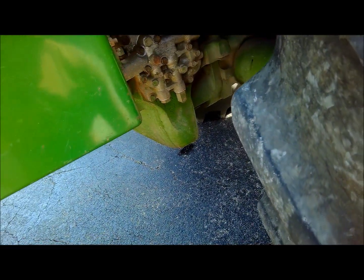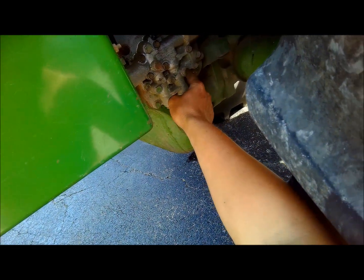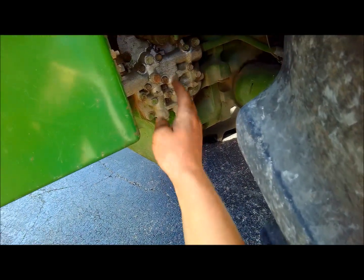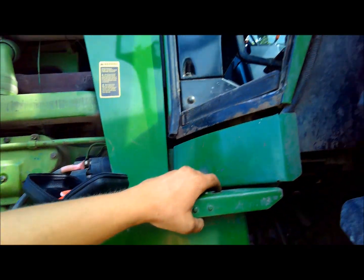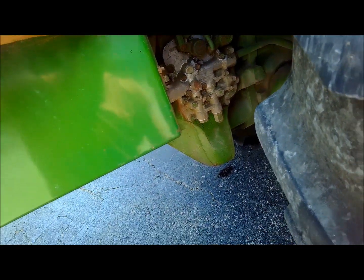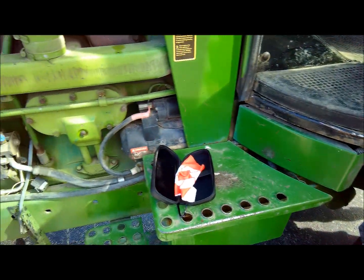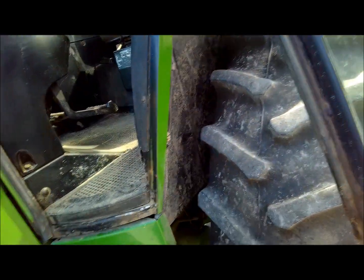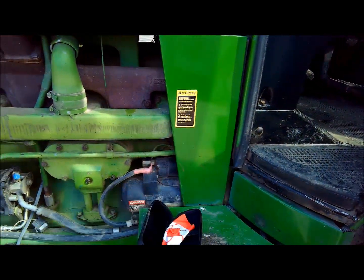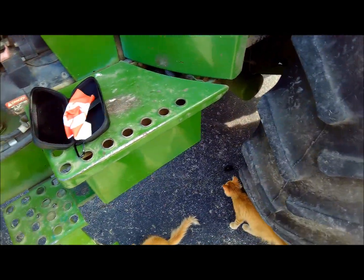And then he said, I'm going to get a service manual from him, but I can check the clutch pressure there on this valve body, and make sure it's dumping the pressure all the way, and that the clutch just isn't out of adjustment. But that sounds more like what's happening, why it creeps forward, and then all of a sudden it's finally all right, is once the piston gets back far enough, it can finally release. But I don't think we'll get into the transmission.